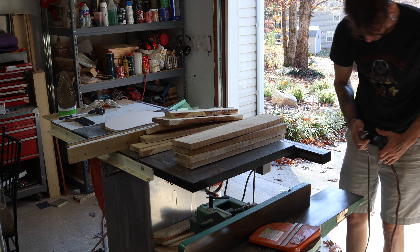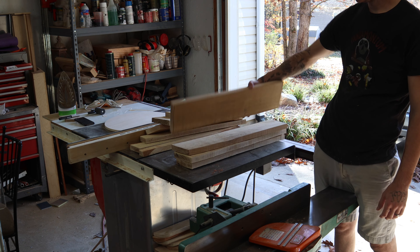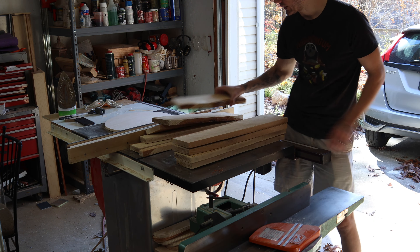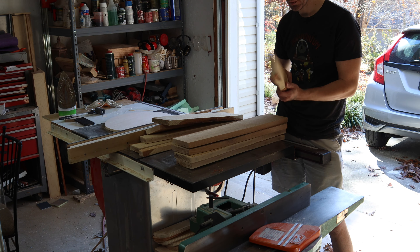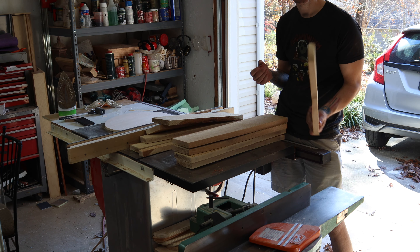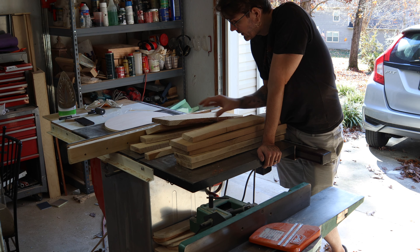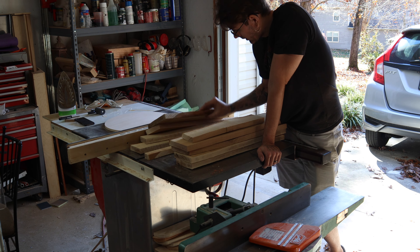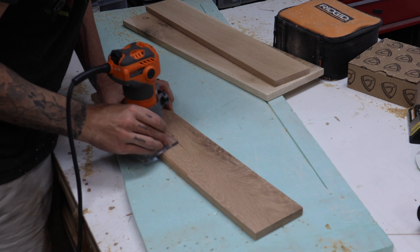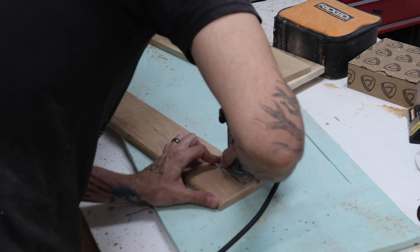You can see there's a lot of boards here and I only need five boards. Since I'm here and I'm running through the process with my offcuts, my scrap, my waste, I always process it as well so that if it's going to move it has the opportunity while it sits on the shelf. For me it just makes more sense to process it now, remove the waste, and store it more efficiently rather than saving a bunch of pieces and throwing them away — because some of them might have a use in the future.